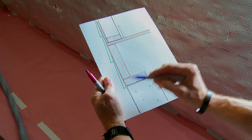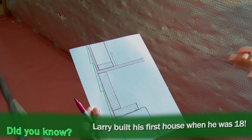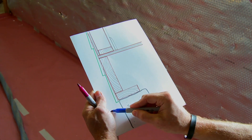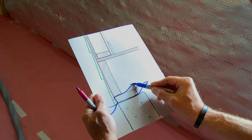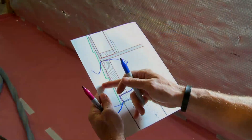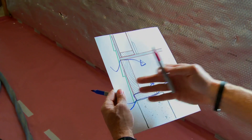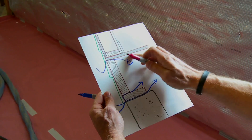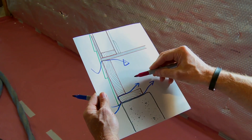What's the problem? The house has negative air pressure in the basement, sucking air in, and positive pressure at the top blowing air out. So in cold weather, air comes in under the siding and through the rim joist area. It gets worse because we put pipes, electrical conduits, fuel lines, and air conditioning lines through the rim joist, creating additional air leakage around those holes. All this unconditioned cold air leaks in, making the basement and the floor right above it cold.